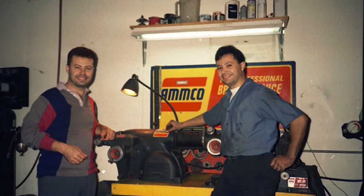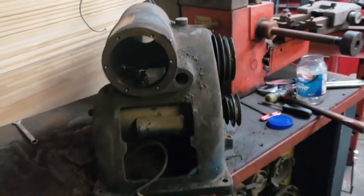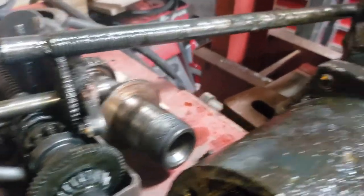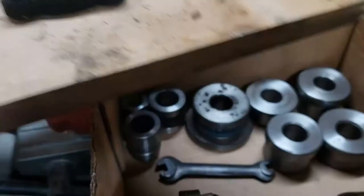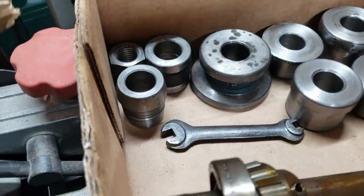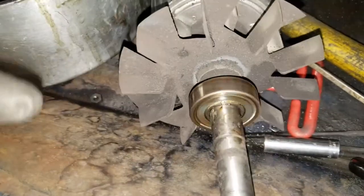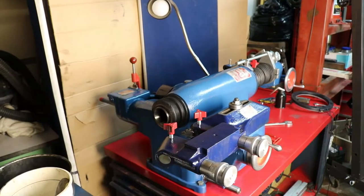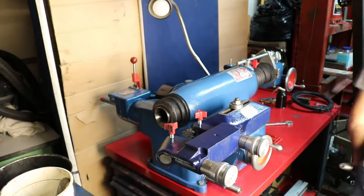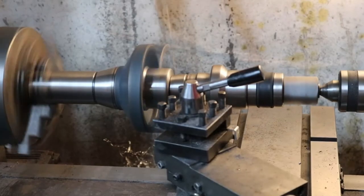Here's my brother and I, younger. I sold that lathe, now I need it again, so I found one at the marketplace and went to get it in Oklahoma. As you can see, the lathe is not in good shape. I had to take it all apart, clean all the pieces and components, and replace whatever is replaceable, like the oil seals and the bearings on the motor. Then I can put it all together and make it good again for another 40 to 50 years. These lathes are pretty good and very accurate as long as you know what you're doing when you're turning it.